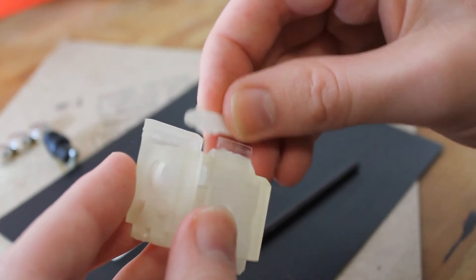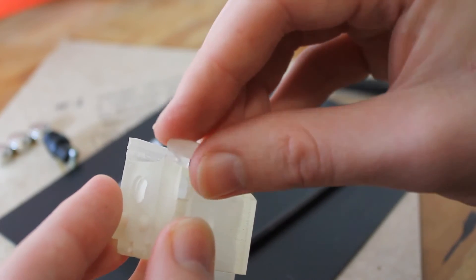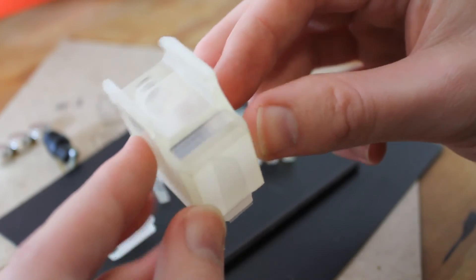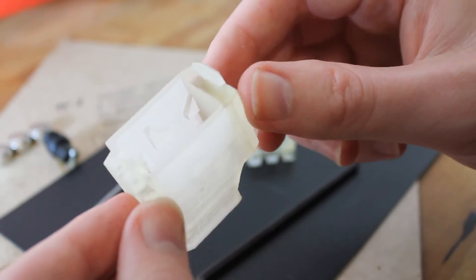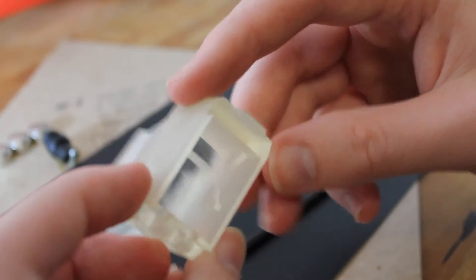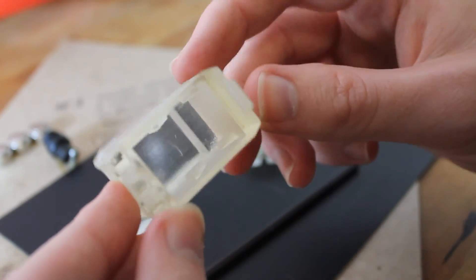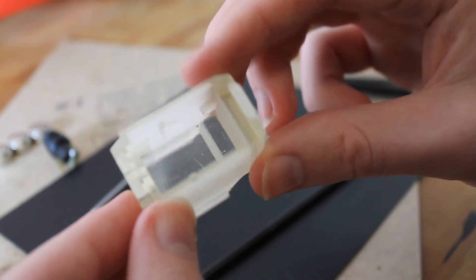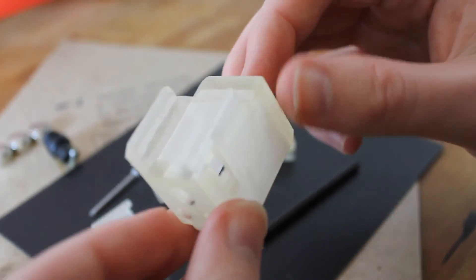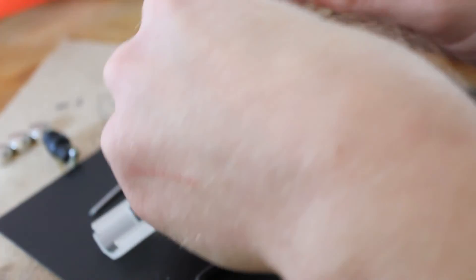As you can see, the rail itself actually cracked right off — that's partly bad tolerances but also because this clear plastic is very brittle. I'd recommend to anyone printing in clear plastic to avoid designs with excessive fragility, because pretty much every single part that could have broken — including the hinges and the back locking mechanism — cracked. That said, clear plastic is really good for prototyping because it lets you see inside and spot issues you wouldn't catch in an opaque material.